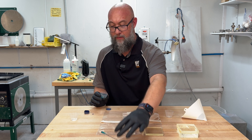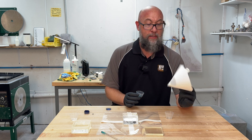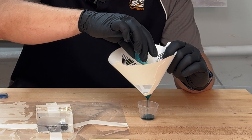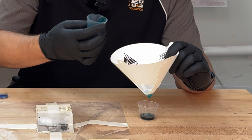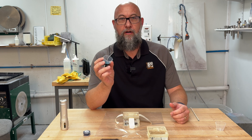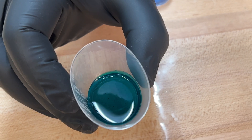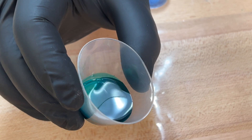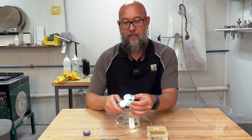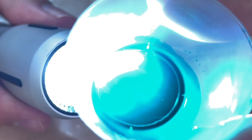I've got a blank cup and my filter — these are just an ultra-fine filter from Sherwin-Williams or any local paint store. We pick these up a case at a time. We'll take our Part B and pour it through the filter into our secondary cup. That's going to filter out the largest chunks of Orasol that haven't mixed in well. We've mixed our Orasol dye into our Part B of Hextal and warmed it up a little bit to get it thinner. I've let this sit for about 10 or 20 minutes and mixed it again. After mixing a few times and filtering, we can use a light to look through our Part B and see if we have any larger chunks — which I don't. It's really well mixed with no particles, so it should be good to go.